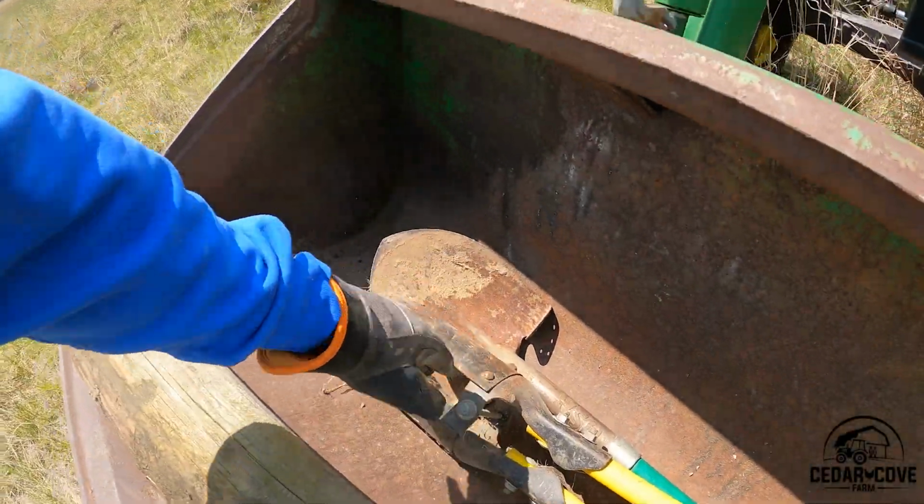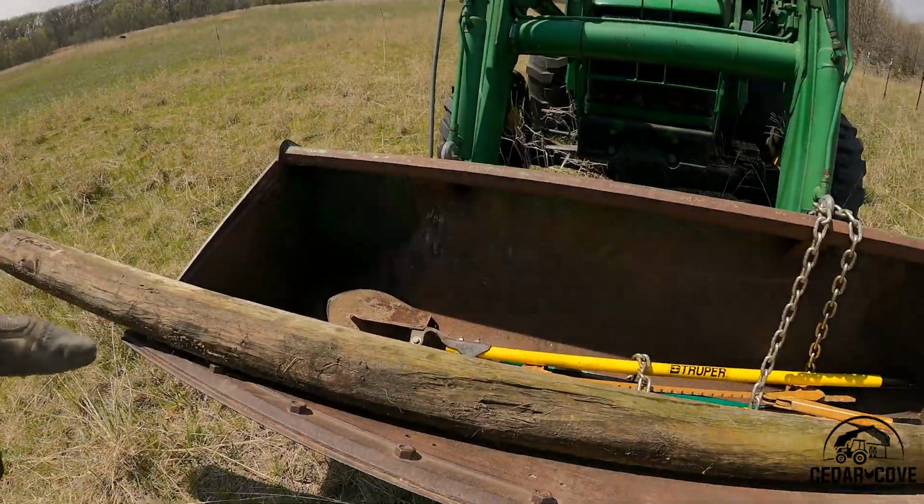Now I'm gonna just dig a hole. For those of you putting in a lot of fence, if you have a tractor, they make 3-point post hole digger attachments. I would rent one, put all your posts in a day and be done. I'm digging one hole, so I've got a couple of shovels. I'll dig the hole, measure how tall that post sticks above the ground, bury this one so I have the same above-ground length, and get it put back in.